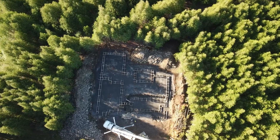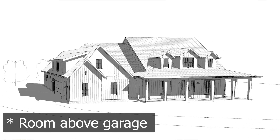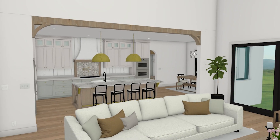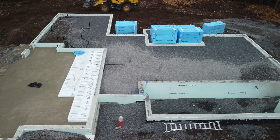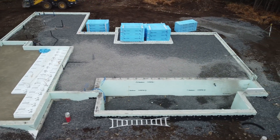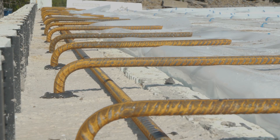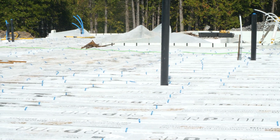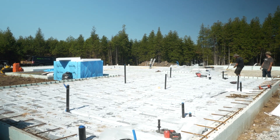We started this particular project earlier in the year. It's a bungalow just under 4,000 square feet with a double garage and four bedrooms, and it's going to be a net zero energy ready certified home. The foundation is ICF, and to keep the slabs separated from the ground, we put four inches of EPS insulation for an R-value of 16, with a plastic sheet barrier for water and air sealing. The clients also chose to have radiant floor heating installed, covered by the concrete floor, so this house is going to be super comfortable in the colder months.